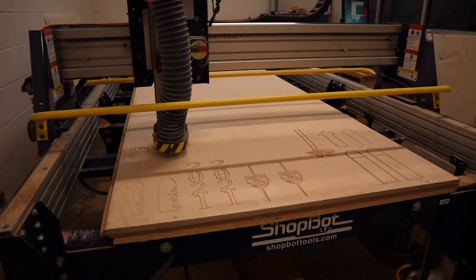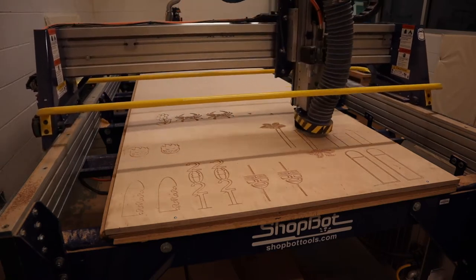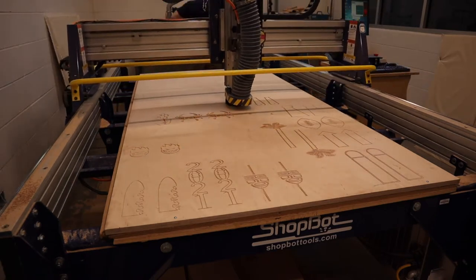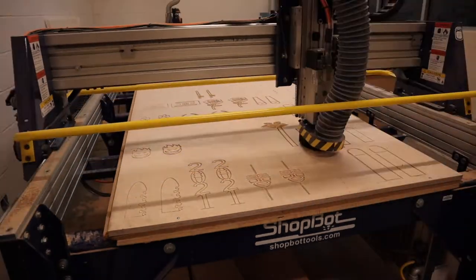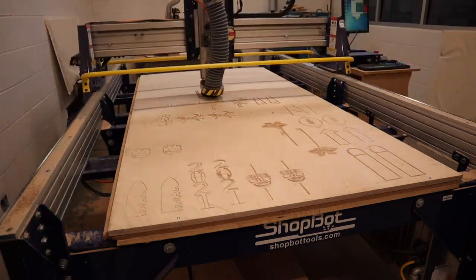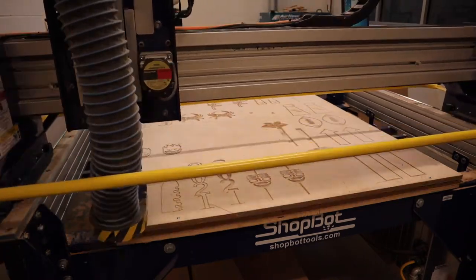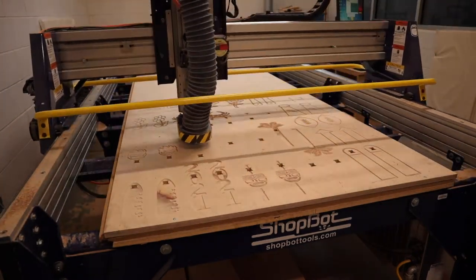That'll be ready soon. It took a number of hours to cut because there are actually four tool paths: one is the V-carving so we can get the little details, the second is the 1/8 inch straight bit to cut out the pockets within the deep V-carves, then there's the tool path to do the pocket that goes all the way through the handle so the arched handle piece can fit in, and the last one is the profile cut around the handle to cut it all out.